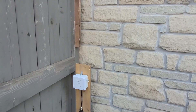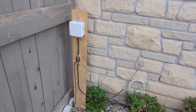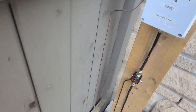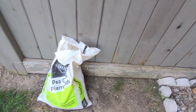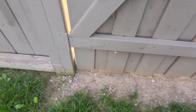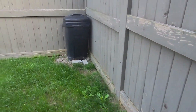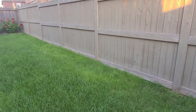Let's talk about the counterpoise element. We start from the transformer box, then to the side wing connector that I designated as the ground terminal. I connected a 71-foot 22-gauge speaker wire to this ground terminal. I then stapled the wire to the fence and ran it downwards. More staples were applied along the baseboard of the fence to avoid sagging.